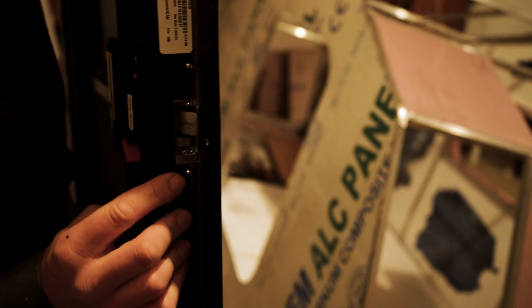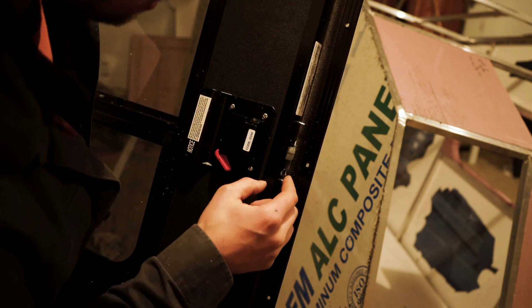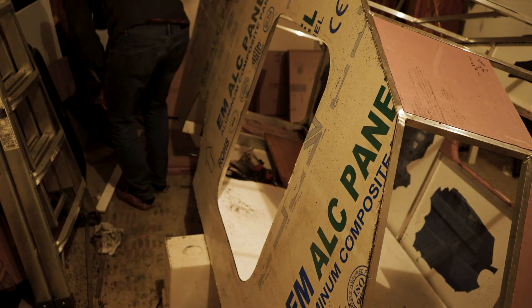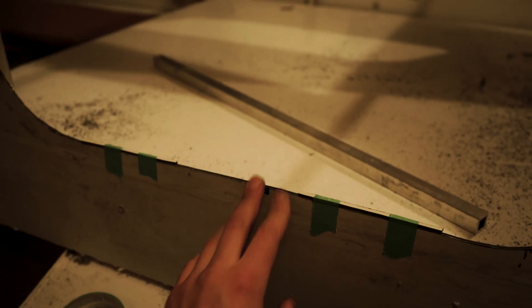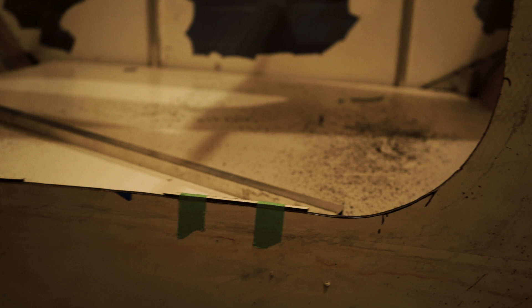This is interesting — it's got these two spikes, self-tapping screws, looks like number eight, coming in about three-eighths of an inch. So you're gonna have to make a little cutout to allow those to go in flush against the wall. I cut a couple of little shims out of the aluminum composite panel — tiny little strips the same thickness as the actual panel — and taped them on. That's gonna lift the door off; I don't want it resting right on the cutout opening. I've got about just under half an inch to play with from top to bottom, so I'll split the difference to have a gap all the way around so the material has room to move with temperature changes.